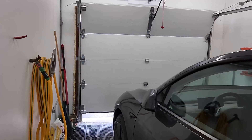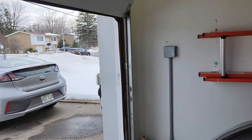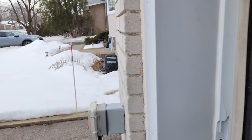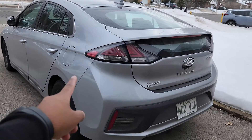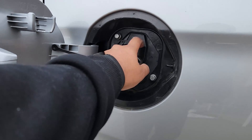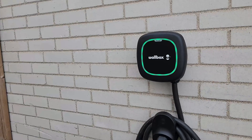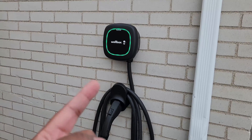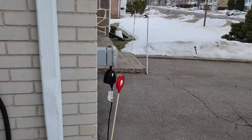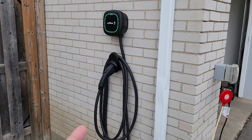So that's the setup inside — a 48-ampere charger for the Tesla. Now let me show you what's outside. This is the wiring that runs outside, and this is the other EV — the IONIQ 2020 EV, which is always parked outside. The charging port is here. This car also takes 32 amperes, so I don't technically need a 48-ampere charger, but I still installed one. I have the Wallbox Pulsar Plus out here, and this one is hardwired — it does 48 amperes. Obviously when the car plugs in, it will only pull 32 amperes, but if I buy another car, at least I'll be equipped with 48-ampere charging at both stations.